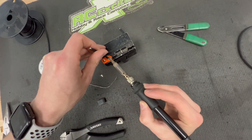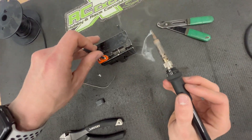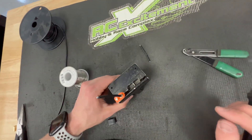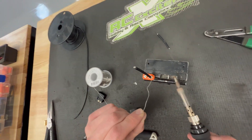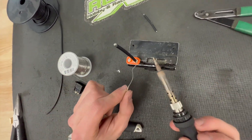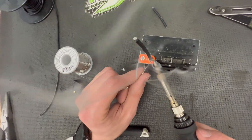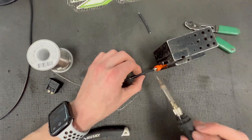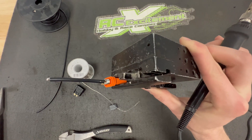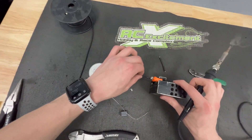All we're going to do is add a little bit of solder to the iron and press that on. As that connection melts, what we're going to do — if the wire still shows — is completely finish that joint by adding a little bit more solder. What I'm doing is a tapping method: instead of holding the iron so the entire joint melts, I'm putting solder where I want it and just tapping the iron so it naturally flows onto that solder joint. I'm not melting the whole joint until I lay it down and make it look nice.